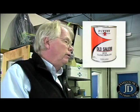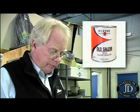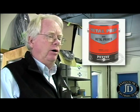Having a drill with a mixing attachment to stir it up well is definitely the way to go. Again, the caution is to mix more than enough paint to do the entire job. For wood systems, the system would involve a clear sealer, the primer, and then the finished product. And for metal substrates — aluminum or steel — you need to use an etch metal primer over the bare metal. Our 6455 metal primer would be the product to use before EasyPoxy.